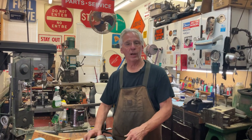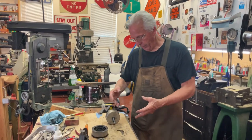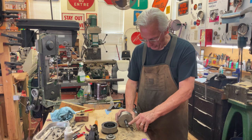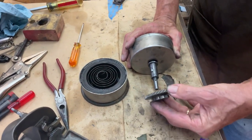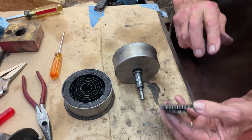Hi, Dyslexic Genius here. I'm working on this Vic-10 and it's a two spring barrel motor. I started to take the springs apart and I talked about pins — there's a pin missing right here. There's no pin in here, and then this gear fits on, and the little pin — in the later video I'll show you — it fits in here and holds everything together.